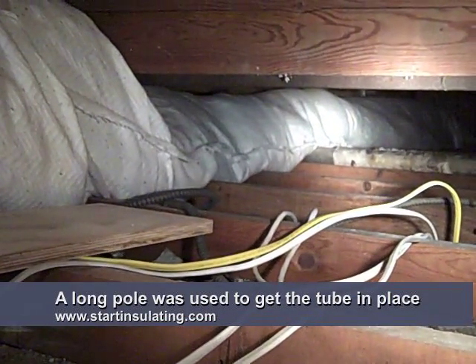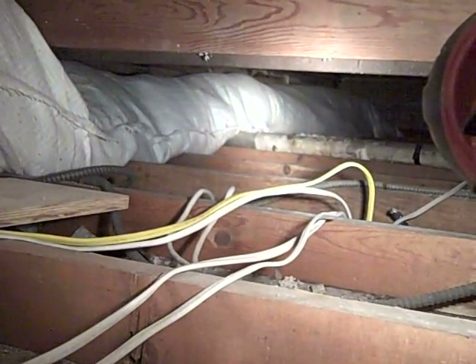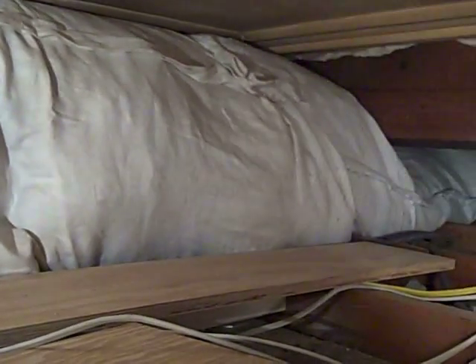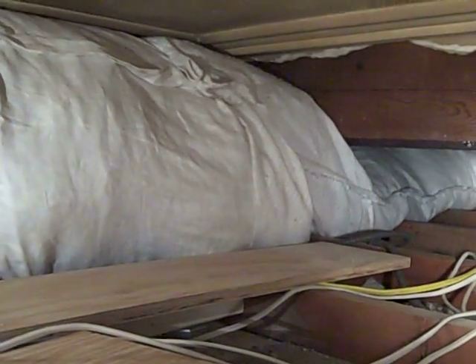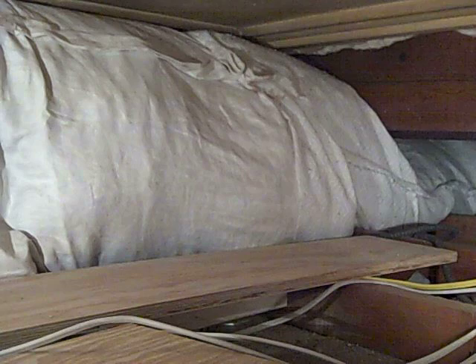The entire tube has been filled with cellulose. It's a little bit hard to see back in that shallower crawl space, but here where we have a diameter of about 24 inches it's completely filled, and it goes from floor to ceiling of the crawl area. That's going to allow us to dense pack those exterior walls — any material that starts to move into this cavity will run into this big sock and stop.